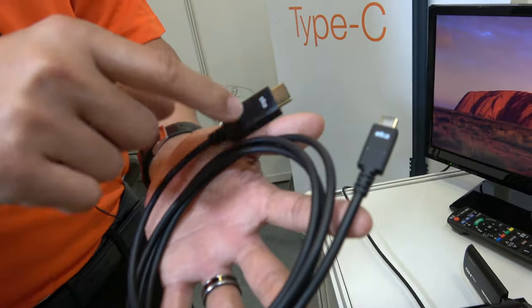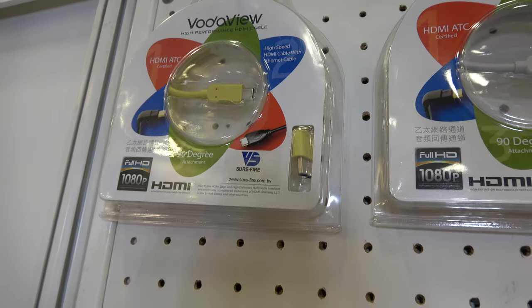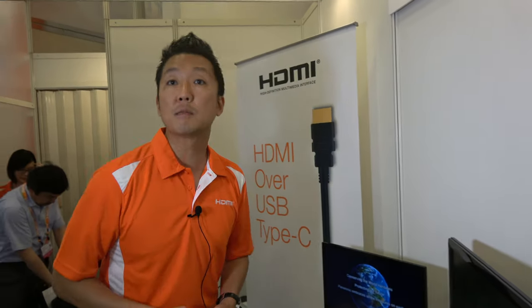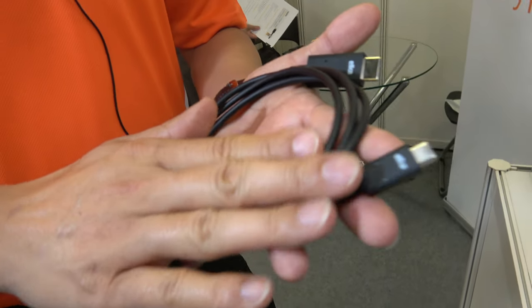This connector is much smaller — just different design philosophies from manufacturers. It doesn't convert anything. The only thing it does is messaging, using the protocol defined by USB Type-C called alternate mode. Alternate mode uses USB power delivery protocol — just a protocol to message with Type-C devices to indicate which mode to enter, since there are multiple alternate modes. One is HDMI alternate mode. That's just a small message handled by a microcontroller, very small and very low cost. The HDMI video and audio signals are not converted — they pass natively from the Type-C connector to the HDMI portion.